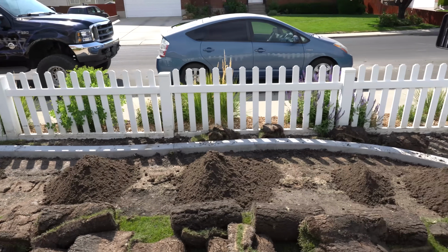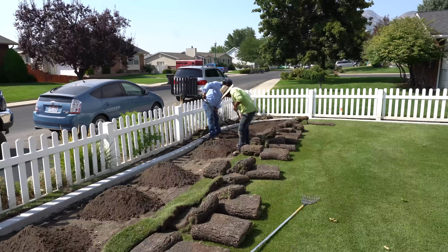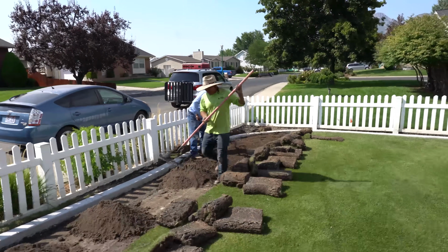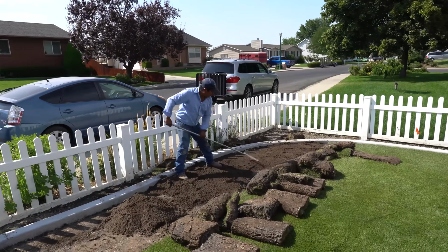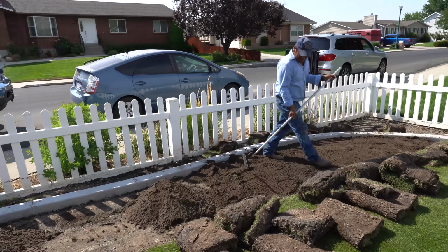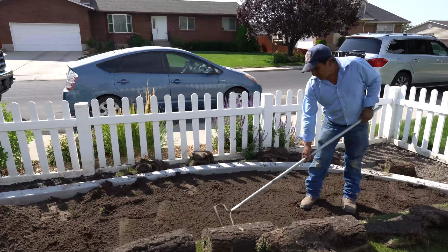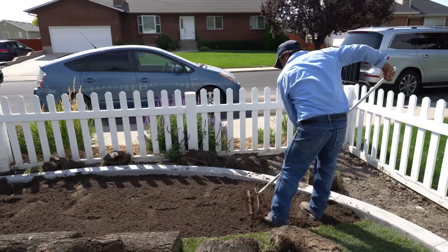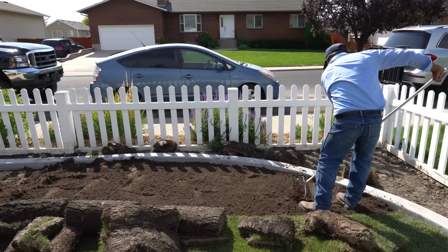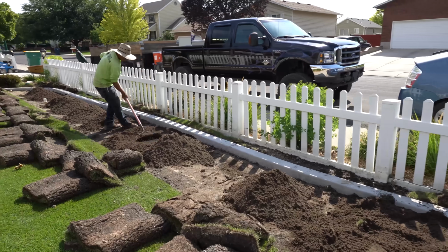Now, my area length is about 45 feet. I know I'm gonna be somewhere between 5 and 6 feet of area that needs help, and on average, I'm gonna need to raise the height about 3 inches. Yeah, the cubic yard calculator calculated I need about 2.5 total yards of dirt, and I was being fairly liberal in my estimate. So we ended up ordering 3 cubic yards because we can always use the extra dirt in the flower beds and the creases along the border perimeter edge.